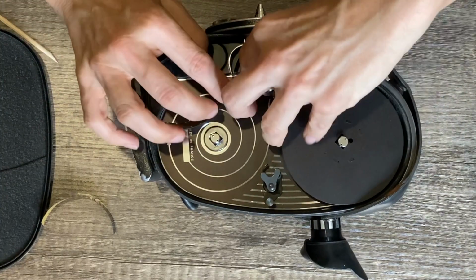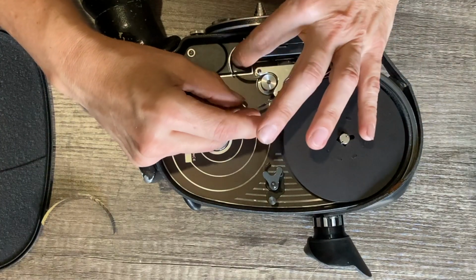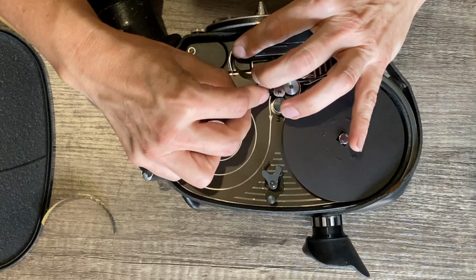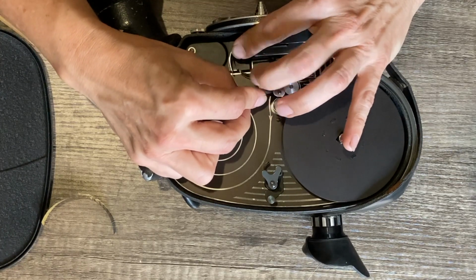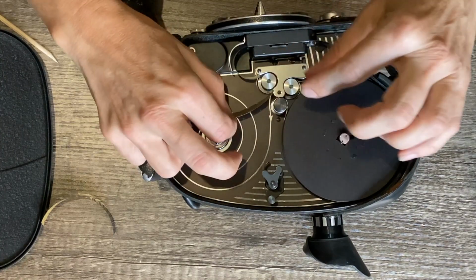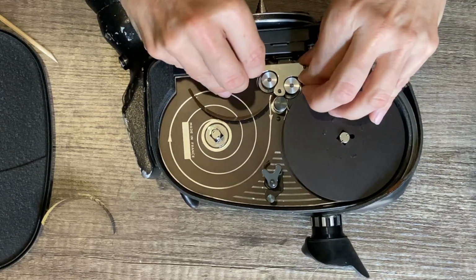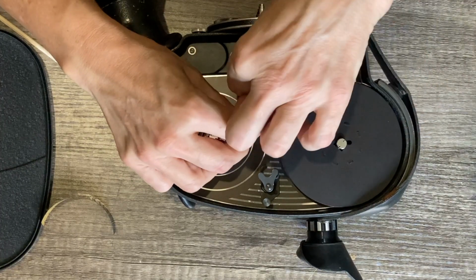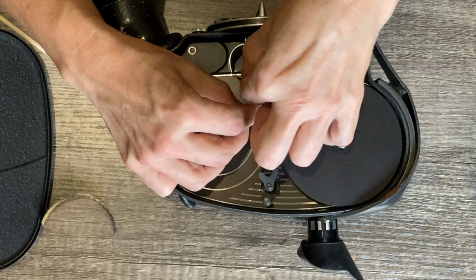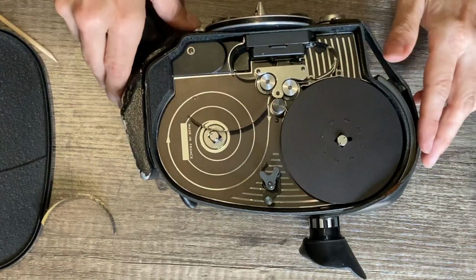Now I'm gonna pop out this metal piece halfway again, and I'm gonna form the lower loop. So what I do is I have it touch this lower loop former, and then from there I back it off a little bit by 1 sprocket hole, and you again push it down and make sure it's engaged in the sprocket hole, and then I'm gonna press it down. So actually I feel like that loop is a little bit small, so I'm gonna lift this up again halfway, and then I'm gonna just carefully back it off another frame, and there we go. All right, and we'll roll off a little bit more.